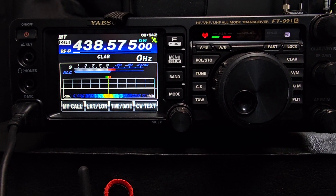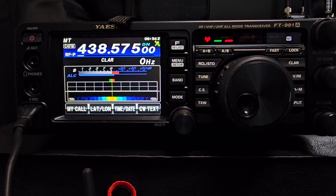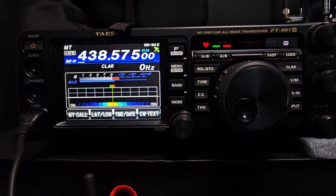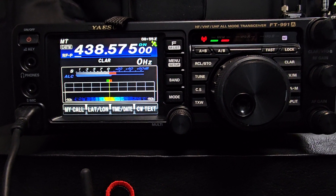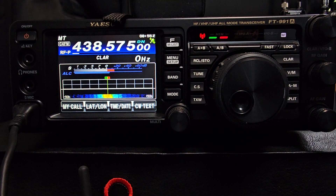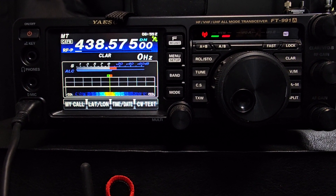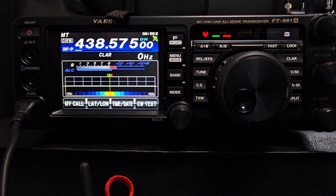The new thing I've done with the 991A that you might find interesting is I've added a GPS antenna to it and it's working live. What I didn't realize was your FT1D handheld will actually act as a GPS antenna for the FT-991A. All you do is buy a cable called the CT-169 that plugs in the back of the 991A. It's a very cool little function — probably don't need it since we've got a fixed location, but great fun. Back to you.